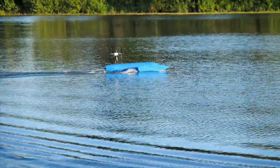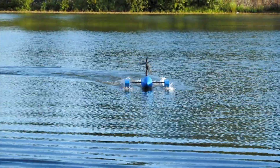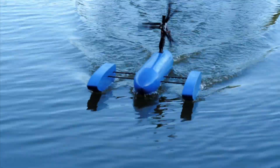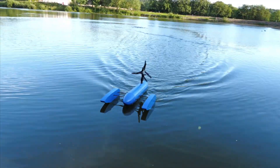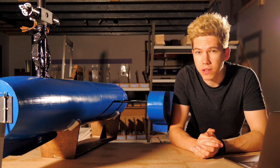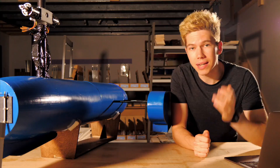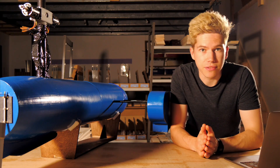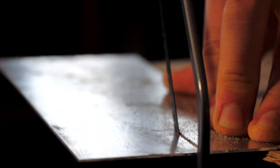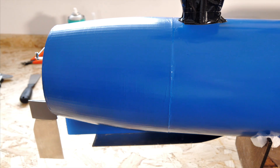On this little blast into the lake I got a chance to observe how my next mod worked — the tail skid — and it certainly worked well. This was probably the most obvious problem on test number one: the tail didn't raise out of the water as expected. So I needed to give the tail a bit more hydrodynamic lift. To do this I simply cut another sheet of aluminium to size with a hacksaw, filed its edges down a bit, and glued it securely to the underside of the boat, leaving a few centimetres at the rear for the planing point to be visible.